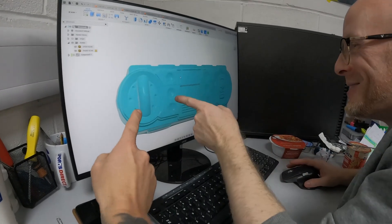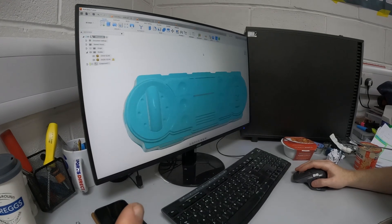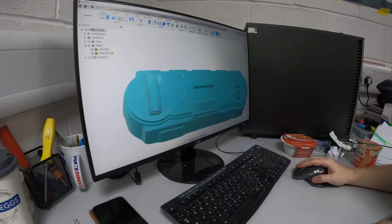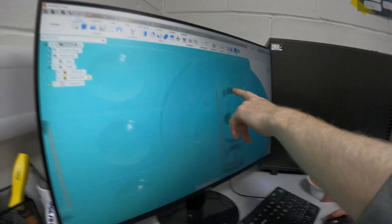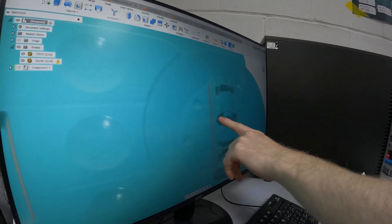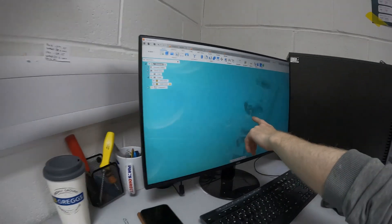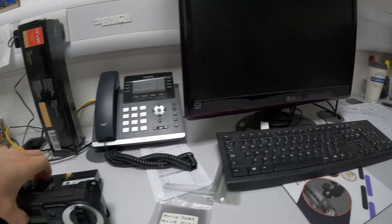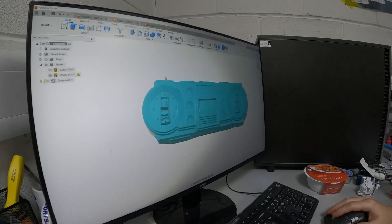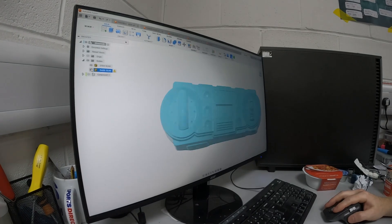Right, so that's the original scan. The idea of the scan data is just to get a profile to work to, so you can do as close as you can get to reverse engineering the part. It gives you an indication of location and such. You don't get a great scan from this because the beam scatter is so large around these areas that it kind of fills them in. You can spend a lot of time doing all the detailing. That's what we scanned — which we'll cut to — but that's the mesh right there. And then Sanders can show us the actual CAD data.